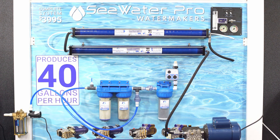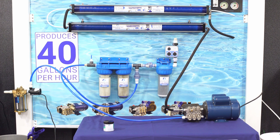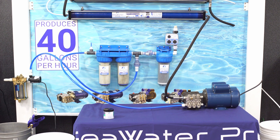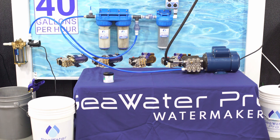For frost protection, add 50% food-grade propylene glycol to the solution, keeping the ratio equal parts pickling solution and glycol, 1-to-1. Systems that are being regularly used every 2-3 days do not require repeated pickling.